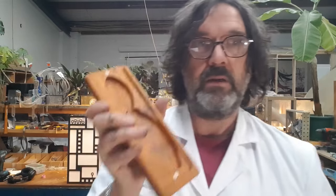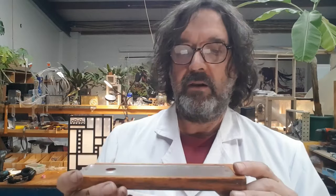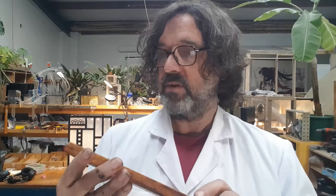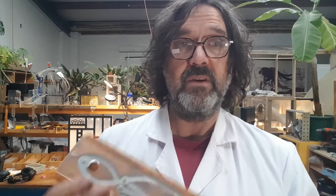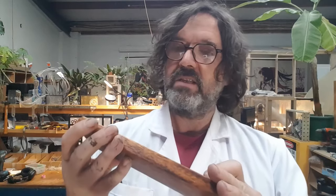Then there's a wooden one, also with a magnetic acrylic lid. The wood is Australian hardwood named Kwila, which I think is absolutely gorgeous — I can't believe they make decking planks out of it. It's sustainably logged and chemical-free, and I use linseed oil to finish the cases, because it's more forgiving than polyurethane. If you scratch or knock it, you can sand out the scratch and oil it again, and it's as good as new.